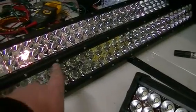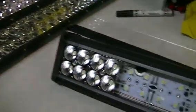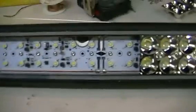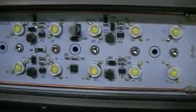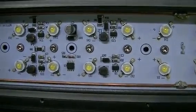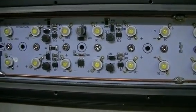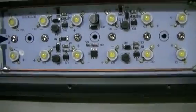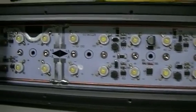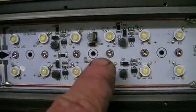The plan was just to rip a couple of cells out and put them in here. I'll check this one for dry joints. So I decided to do a teardown and to my surprise there are lots of little what look like oscillator circuits. I'm assuming these LEDs are pulse driven, whereas I thought they would just run from 12 volt DC with three in series hooked up in parallel with another three in series. But that's not the case — each three have their own little circuit.